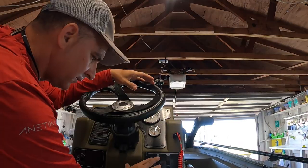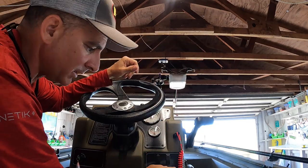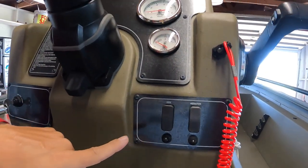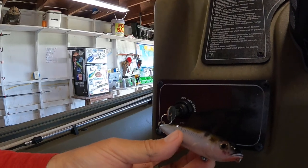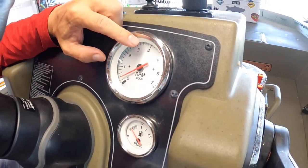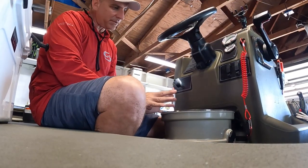On the center console you've got a navigation light on/off that'll kick the lights on if they're plugged in, an aerator for the live well if you're using it, navigation lights on and off — that's pretty much everything on the console except for start and stop. RPMs are handy for the break-in period; I was able to keep it at 4,000 for the first 20 hours.